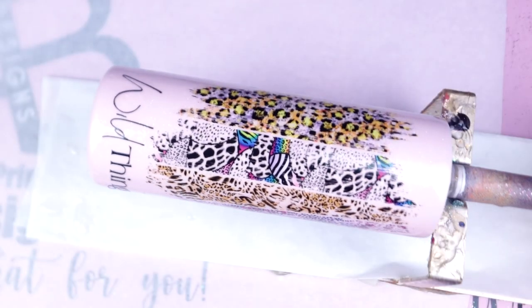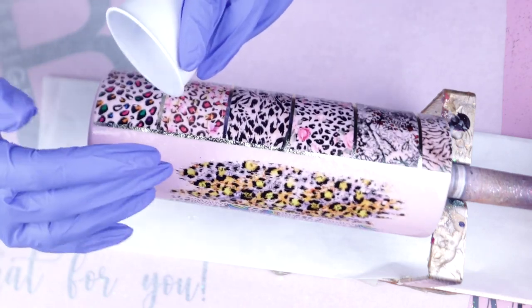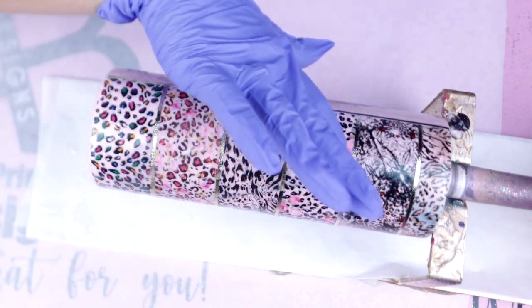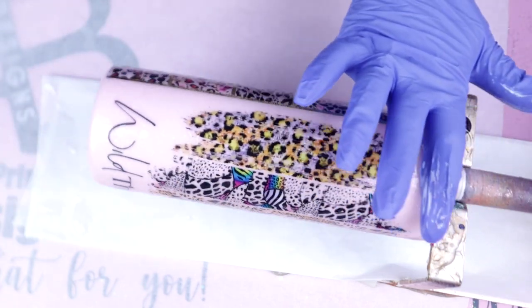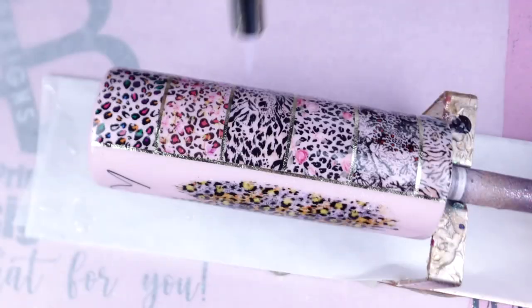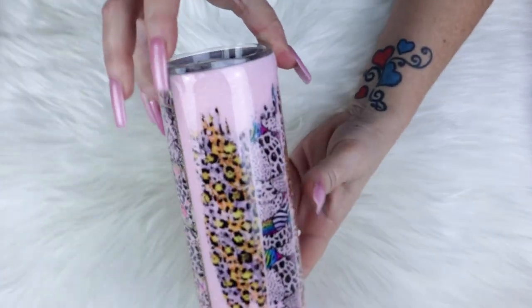Once that step is complete, we're now ready for another coat of epoxy. I am using Fast Set from CounterCulture DIY for this second coat of epoxy. After this Fast Set has been applied, it will take up to three hours for it to cure, but it does take three to five days to be fully cured. As always, make sure you use your heat torch to pop any bubbles you may or may not be able to see. And here she is, fully completed.